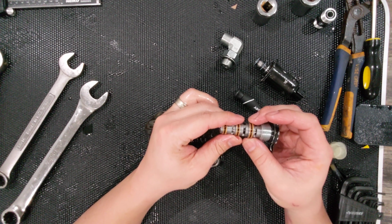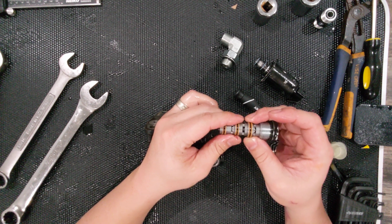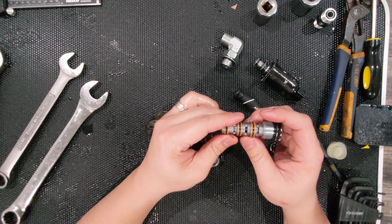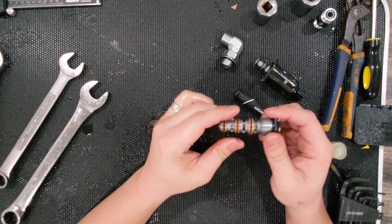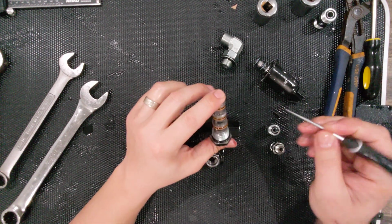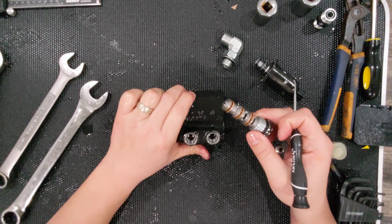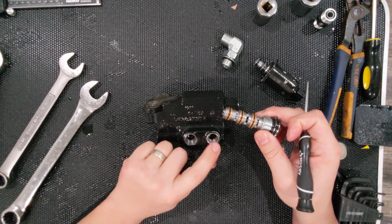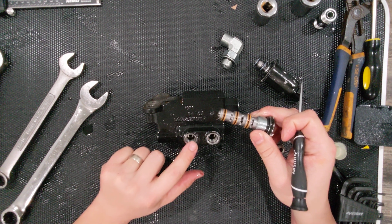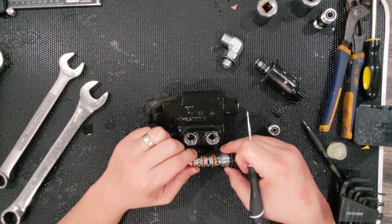If you look at tractor data and a few different things, you might get some conflicting ratios of what the fluid is, but everything that I've read that I trust, like the technical manual, says basically it splits 50-50. You can go on YouTube and find other graphics that show you what happens. This is for the implements, and this is for the steering. And this is sitting in behind it.